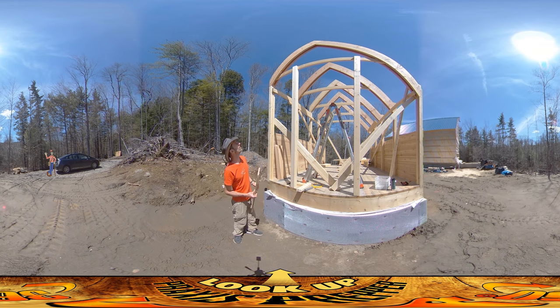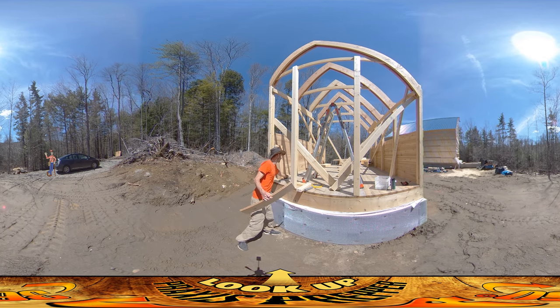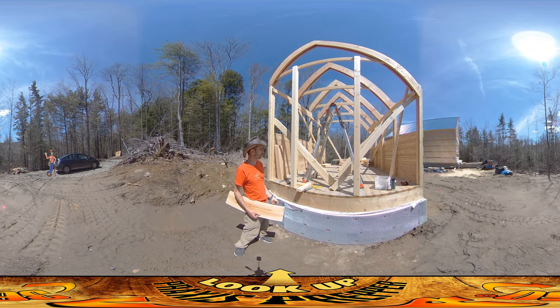One other thing I wanted to mention is that to get the mark between this point and the point up there, you could put the board up and put the level up next to it and figure it out that way, and that works pretty well. But the best way to do it is to use the plumb bob. That's that weight with the point at the end of a string, having it dangle down and marking the points at the top and the bottom. That gives you a perfect line parallel with the direction of gravity.